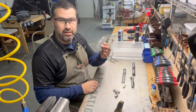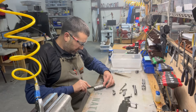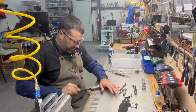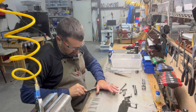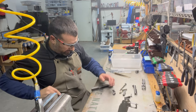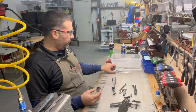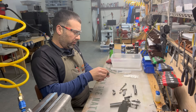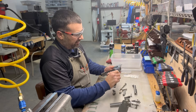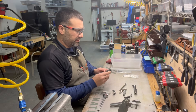This is going to be a really cool pistol. The first thing I like to do is take some thousand-grit paper, put some oil in there, and clean up the rails — the inside rails on the slide and the frame — so that when I take my measurements there's no trash or bead-blasting material. You really don't need gauges like this, but it sure makes life a lot more enjoyable. That's a slide rail gauge — seven hundred fifty-one thousandths is our inside slide rail dimension.